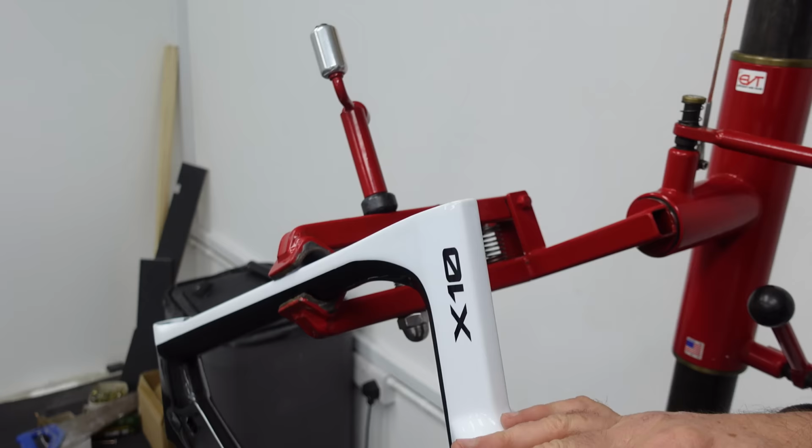Rob also suggested that they have thrown a lot of carbon at this frame. They've thrown carbon at this bike, okay, to make it safe and structurally strong. I mean, it's quite heavy. If you have poor construction techniques, but loads of carbon, then it's basically a way to try and ensure that you have the strength in the frame, but as a side effect, you increase the weight. Now, on that point, Rob grabbed a Canyon frame as a comparison, and we made a few points.